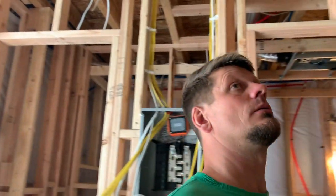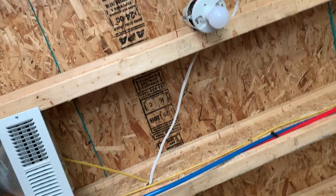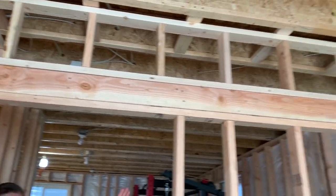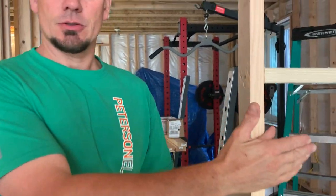This is going to be a bedroom in here. If you're doing a ceiling fan, make sure you use a ceiling-fan-rated box. Here's another important factor — look at the header, there's a barn door on the outside. That's really important for your switches. If you go putting your switches here and the barn door goes that way, you've just covered your switches. I can fix it with a Lutron system, but that can be a mess.